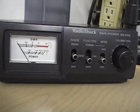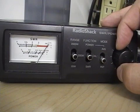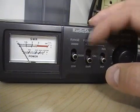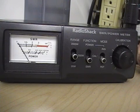Now we can go to channel 40 and check there. You want to recalibrate — it's going to be slightly different on some channels depending on the type of radio you have. Check the SWR on channel 40 and as you can see the needle drops much lower. We have just under 1.1 on channel 40.